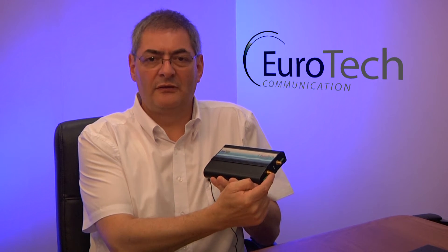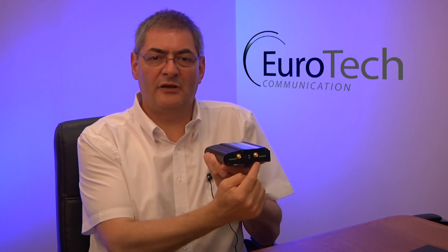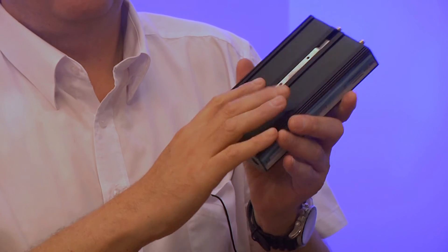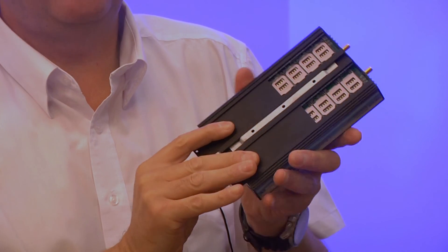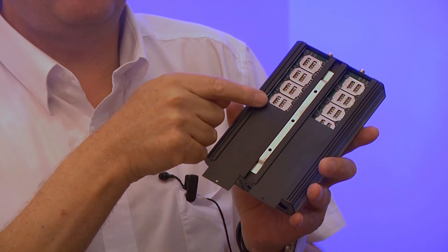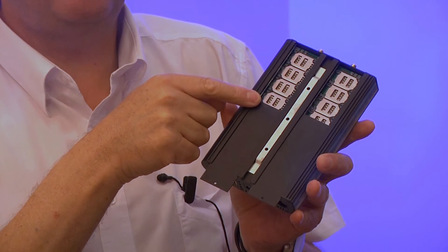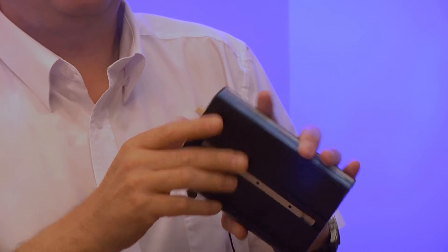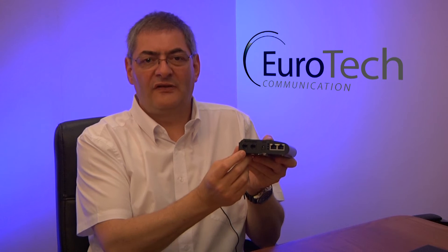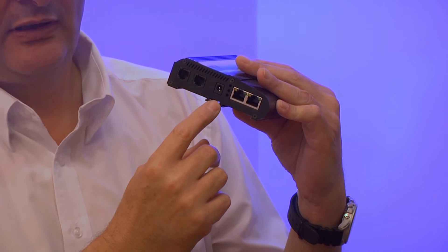On the right-hand side of the unit, there are two antennas — one for each channel — and LEDs showing the channel status. Turn over the unit and slide back the two panels. You will see eight SIM sockets for insertion of SIM cards: three alternative SIMs for each channel and a full SIM allocated for movement of the SIM image when working with the SIM server. On the left-hand side, you can see an FXS connection, an FXO, a LAN connection, a COM connection, and the power supply input — a 12V AC-DC adapter, 2A.